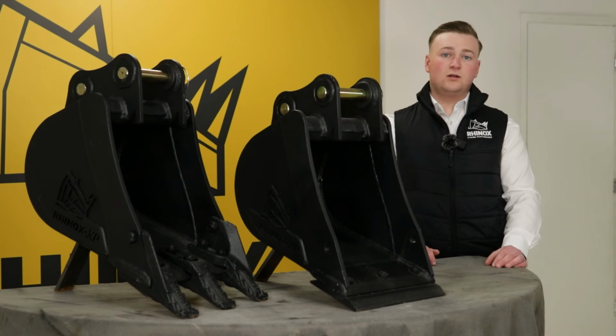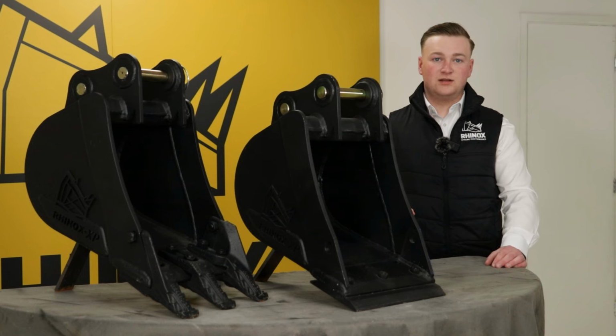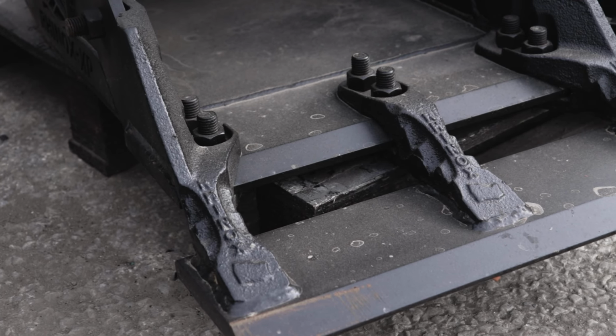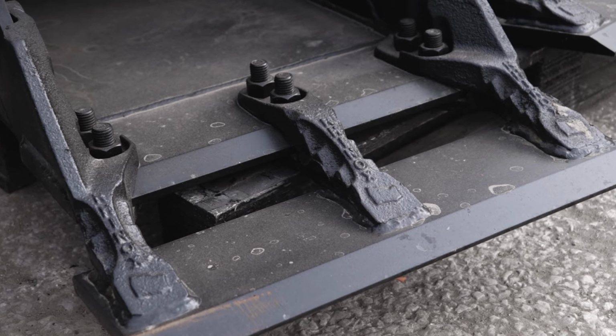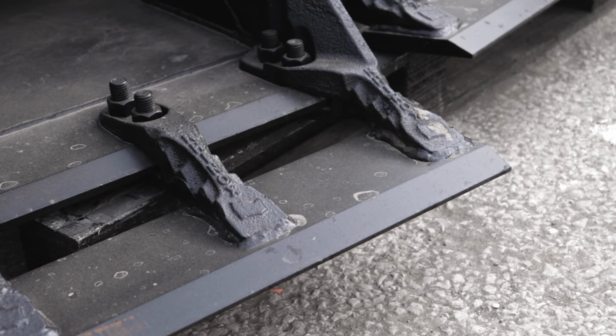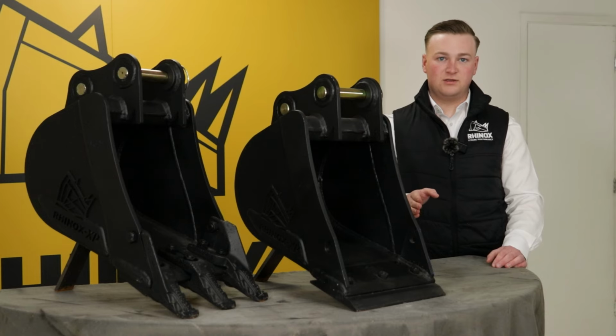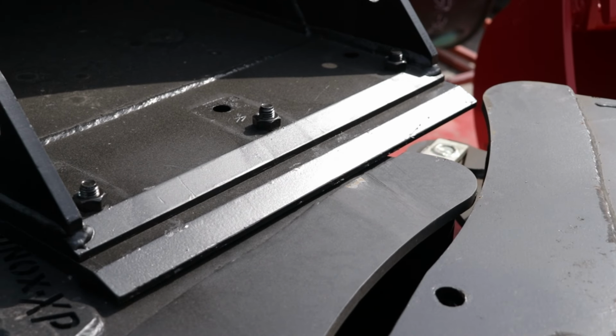While we recommend that you have bolt-on bladed buckets, this isn't to say that we won't do it, and there are customers that still have this, because at the end of the day we do what's right for the customer. But if you're asking for recommendation, this video has been a reason why we would recommend the bolt-on blades over welding blades onto your teeth.